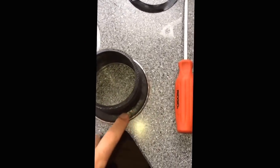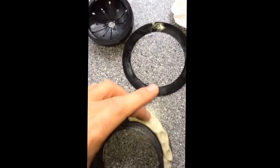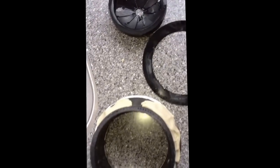What I'm going to do is coat the underside of this with plumber's putty. You can roll it up into little pieces like that and just press it down into place. When you end up tightening this up, all that stuff will just smoosh out and you just wipe off the excess later. So kind of like that, all the way around — I've got a little bit more to put on there.